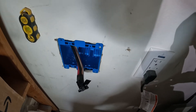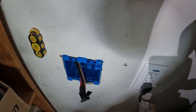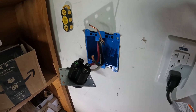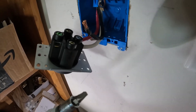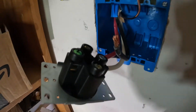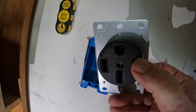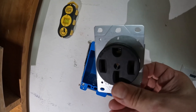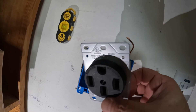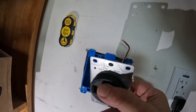We're going to go ahead and wire the NEMA 14-50 outlet — that's two hots, a neutral, and a ground. Here I'm wiring that NEMA 14-50 outlet. I'm using a square head to tighten these up when they go in. On the front I've got three blades: hot, hot — neutral's on the bottom, ground's on the top. So hot, hot — red, black, either order — white for neutral, ground on top. There's a bare ground in the 6-gauge Romex.